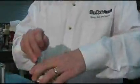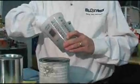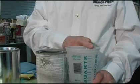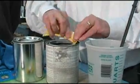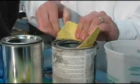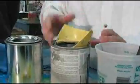Whenever I do any finishing, I carefully open the can all the way around, and then I'll do some stirring, using a drill-mounted stirrer. Then I always use a secondary container. In a nutshell, we pour some finish into a second container, use that container, and then seal up the can to protect the leftovers. This is the best thing I've seen. A lot of other manufacturers make similar ones. These are like $1 in your paint store, and you can reuse them over and over. Frankly, it's the best investment because it keeps the groove in your lid from getting paint in it.